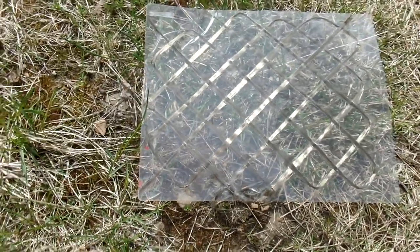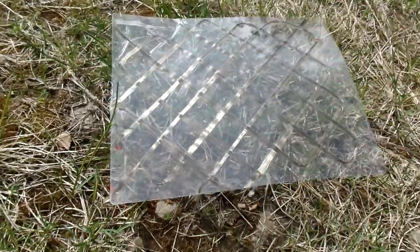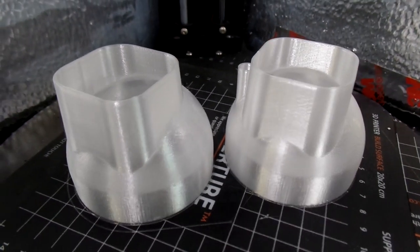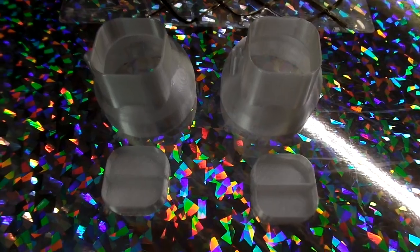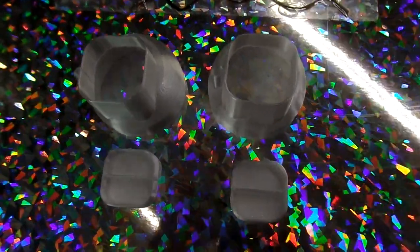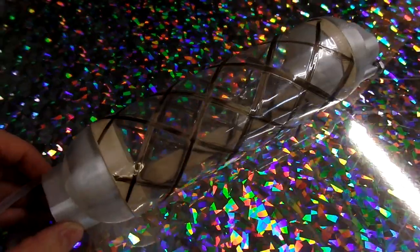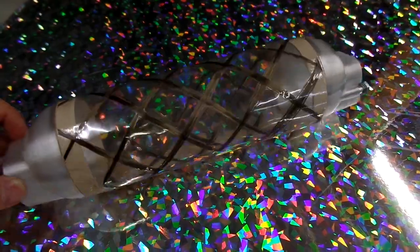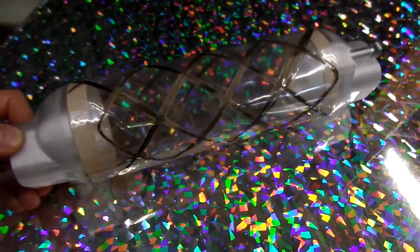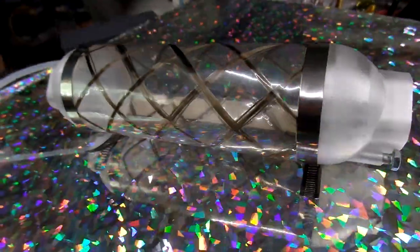I made this heat-laminated sort of composite. It's really beautiful, but the question is will it work to actually hold pressure? So I made some end caps, 3D printed from PETG. There's a little airlock on the top that slides in. To stick this to my basalt sheet, I used double-sided duct tape. I rolled the sheet up into a little tube, sticking it on the end caps with the tape and sealing the one edge. I secured this thing down using hose clamps — little stainless steel hose clamps. Look great. I put in some foliage and occupants.